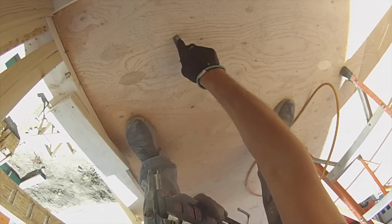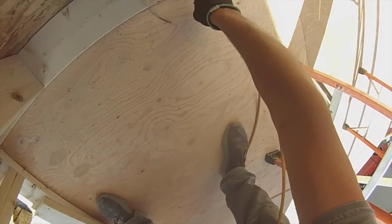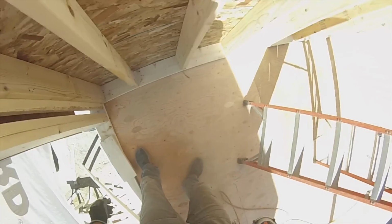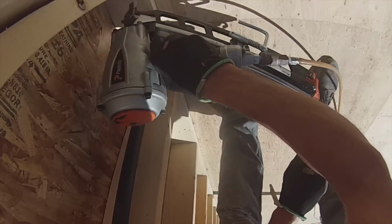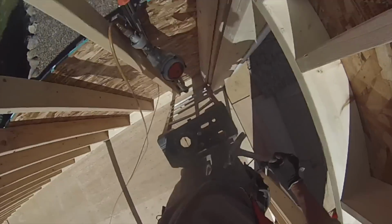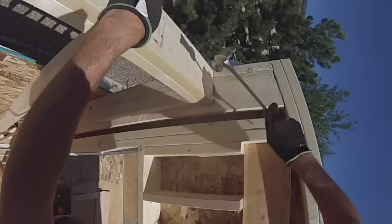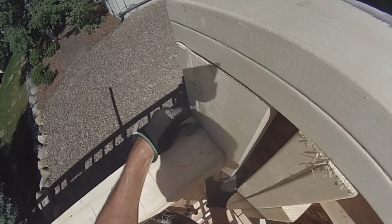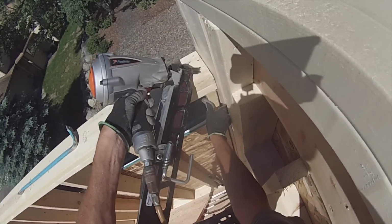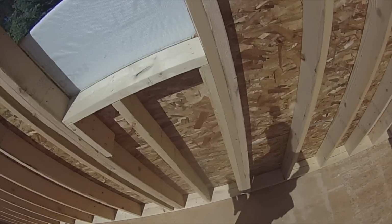Now you want to look for a floor joist. So I'm looking for all my screws. And when I did my hinge nail, I actually put a hinge nail by every floor truss. So if I'm looking for my hinge nail, which is right here, that's where a floor truss will be. And you're nailing into something solid. Last one. Now we're on the other side. Pull my kick, pull the nail. Always pull your nails. Flush on the outside. Voila.